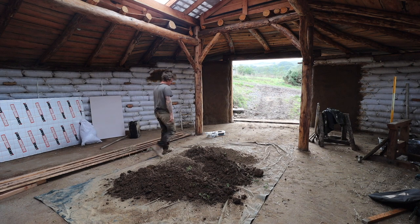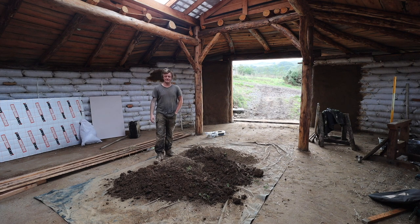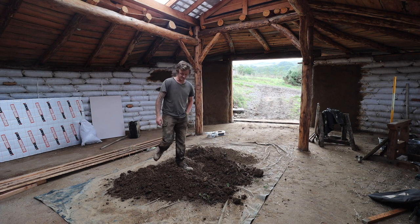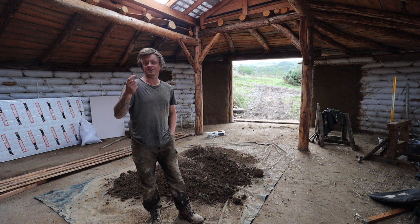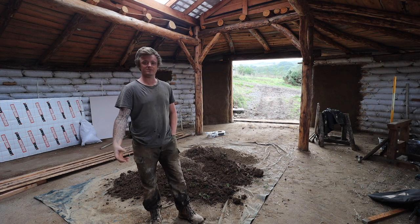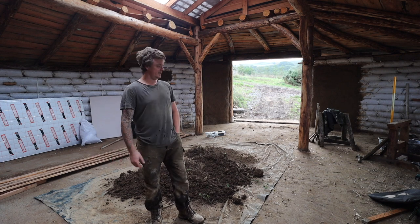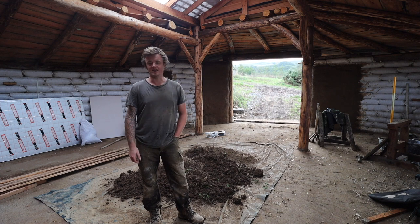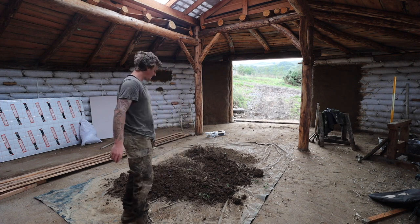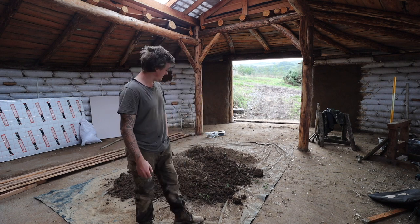So it's Saturday morning, and today I'm going to do some more cobbing. I'd like to be doing the external plaster and make the most of this good weather, but it's just not set hard enough yet. It is set, but it's quite a thick layer, the first coat, and it needs quite a long time because lime is quite slow to set. Well, lime putty, at least the stuff I use, needs at least 7 days to set, and we're only on about day 4 or 5. So after today's cobbing, I'll probably start doing the second coat of the external stuff on Monday.